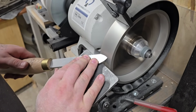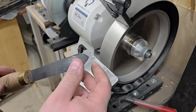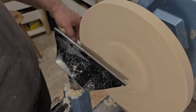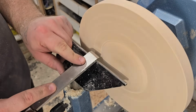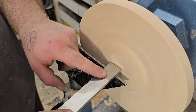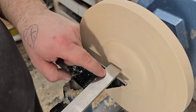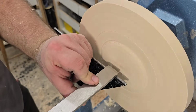Again, usually my bevels don't look this pretty, and that's sharpened as well. I feel a nice burr all the way around. Speed is the same, 1484.5 RPM. Again, I like to keep the negative scraper slightly more towards down. Handle goes slightly down, but that's only for negative rake scrapers. With standard scrapers, my end of the handle is slightly higher than the cutting edge here.